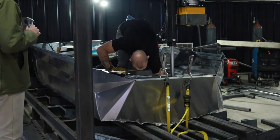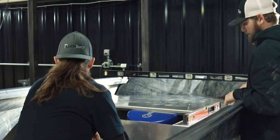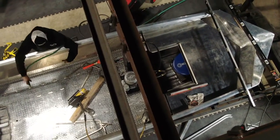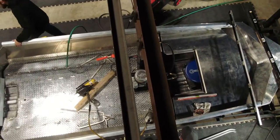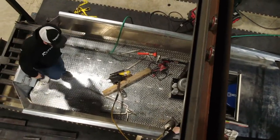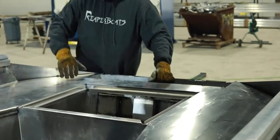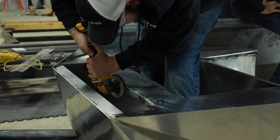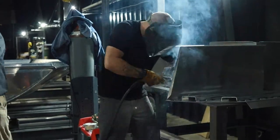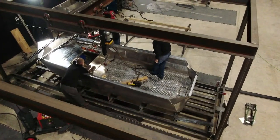We went heavier on extrusions. There's things like an extruded center keel that gets left out on a lot of boats in our segment. We're using a heavy wall extruded center keel, but actually the two pieces of the hull come in together and it's seamed down both sides and stitched on the inside, whereas typically when you put an aluminum hull together, it's just one tig weld with a lighter extrusion and a stitch weld over the top of it.